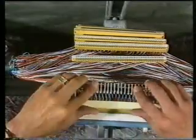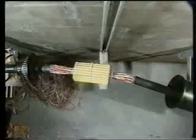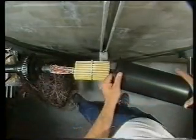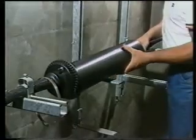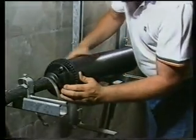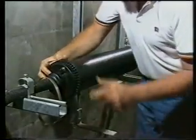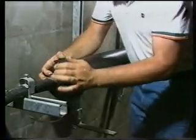Step 13: Splicing of conductors is now complete. Step 14: Slide the main body sleeve over the splice and couple to the large end cap using the two half clamps. Step 15: This will automatically establish the correct position of the small end cap, eliminating any accurate measuring by the cable splicer.